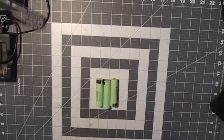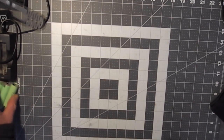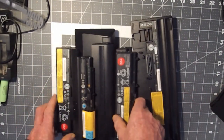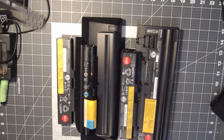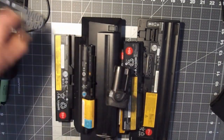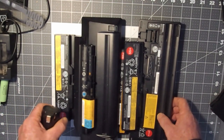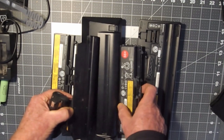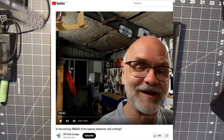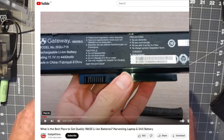So one of the first things you're going to need is a power source, and you're going to need 18650 lithium ion batteries. Well, the good news for those is if you have a local recycling center, landfill or dump where you can go in and do some harvesting, run down there and grab all the old battery packs that you can find, whether they be from notebook computers or even like this from cordless power equipment, because they all contain 18650 batteries that can be harvested, usually in these packs, which is the same thing where I got these for the same purpose. You can take these apart in a vise, and you can refer to some of the videos that I'll link down below in the description to see the safe and effective way to do that.